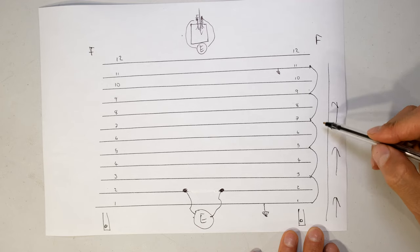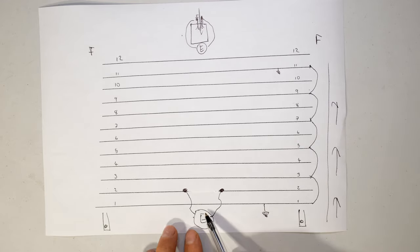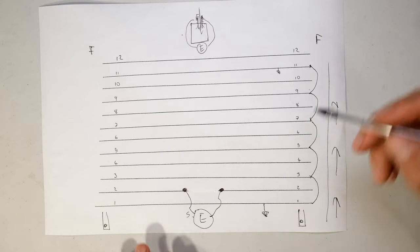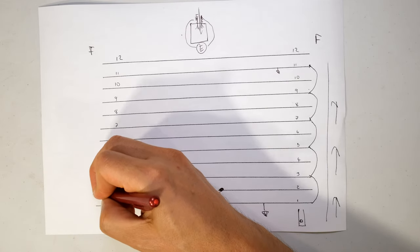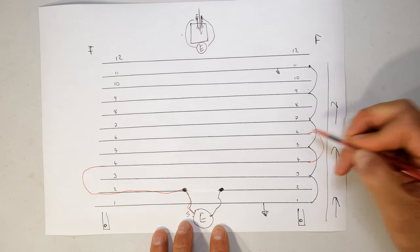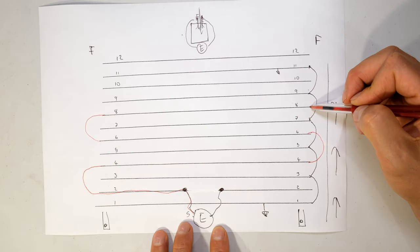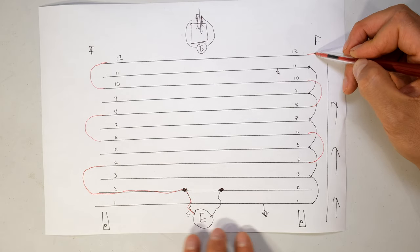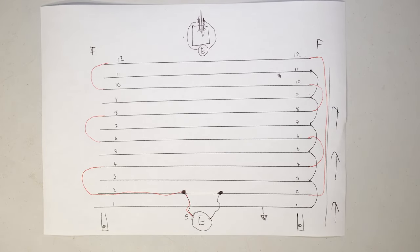You cannot connect any live to any of those earth wires. So the sending wire starts on line 2 - that goes to 4. Line 4 goes round your entire fence, comes to this side, and goes to 6. Six goes round, comes to this side, goes to 8. Eight goes round, goes to 10. Ten goes round, goes to 12. Twelve is the return wire going all the way back - not touching anything - to 2. And that maintains a series circuit.